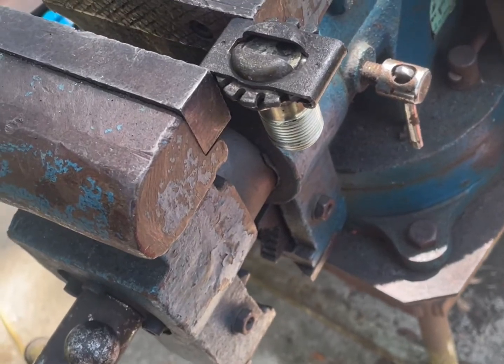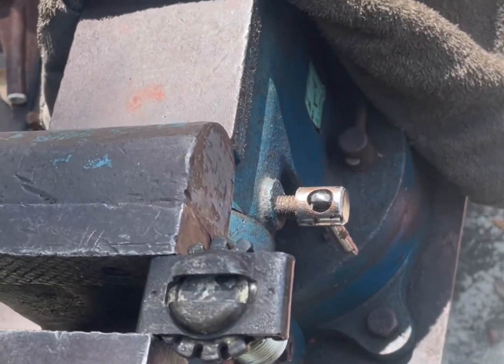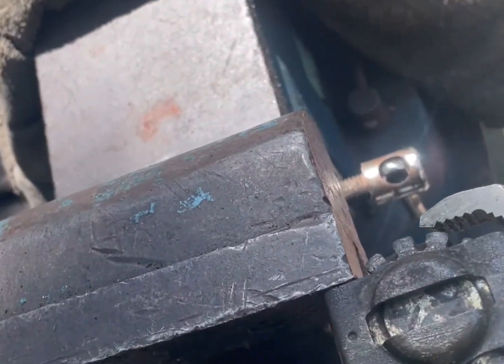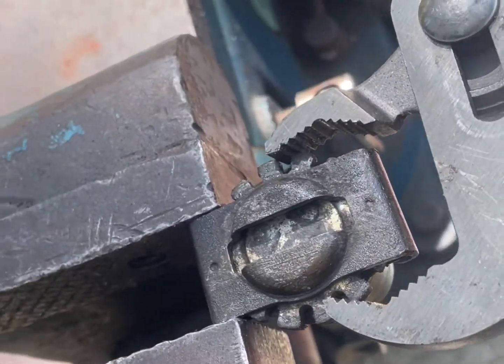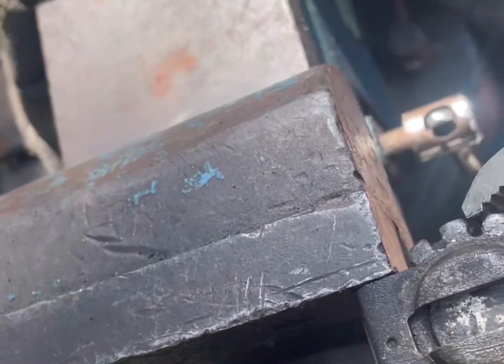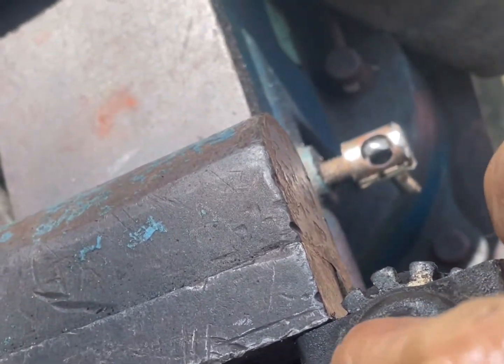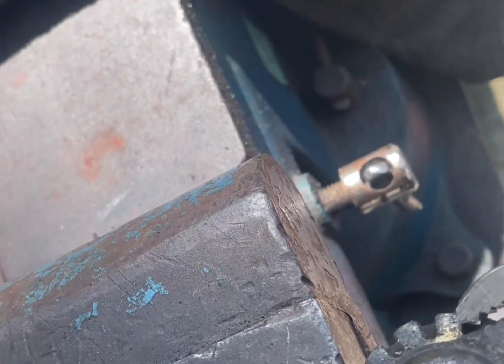All right, I had said earlier about cleaning parts and making them move. Okay, now this is that adjuster I had spoken about. Move all over on you here. What I like to do is get that clamped in there. There we are. Get that clamped in somewhere. It doesn't have to be tight. And work this adjuster up here. You'll feel it. That little dot that's right over here. That's the detent area. That grabs in between those pieces.